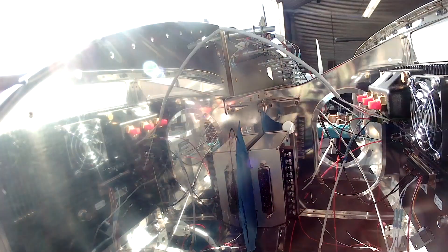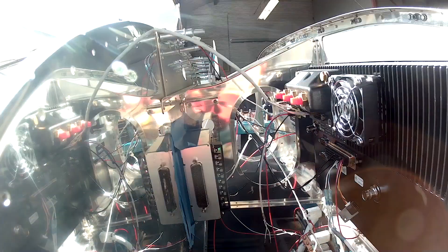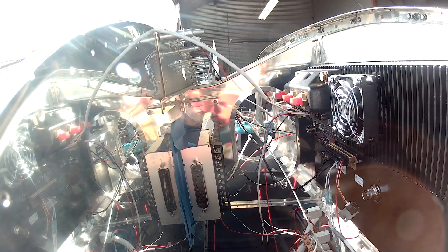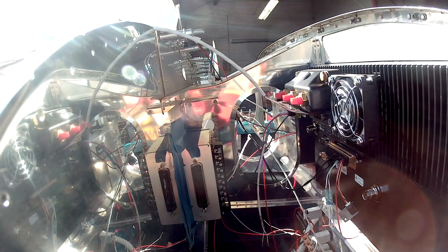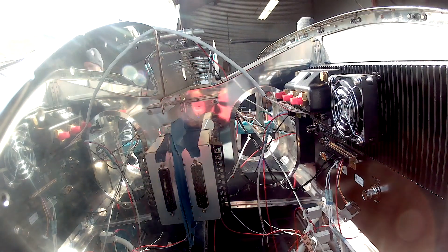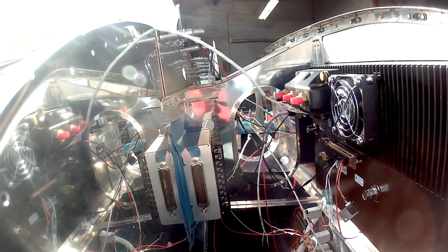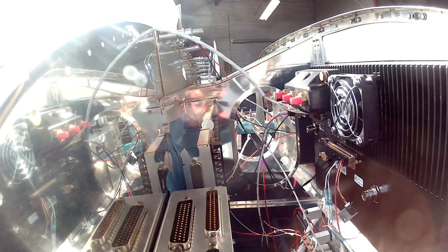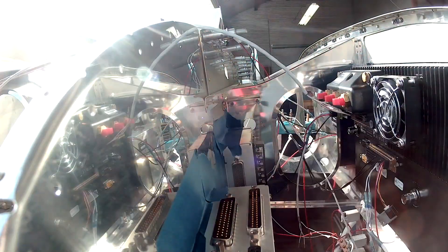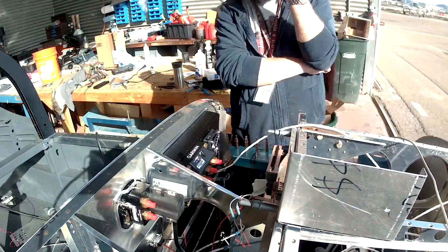Here's the idea: you can see we're focused inside the subpanel — Garmin displays on the right. I now have the GAD27 here taped up against the subpanel. If we like it in this location and it looks like it won't be too much of a pain to route the wiring, we'll replace the tape with bolts, washers, and nuts. And there's the Garmin engine analyzer — I thought let's just see if I can mount it next to it.